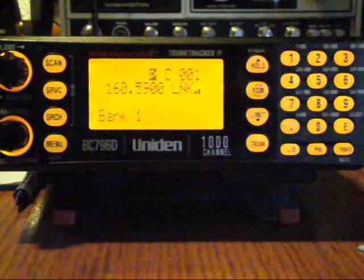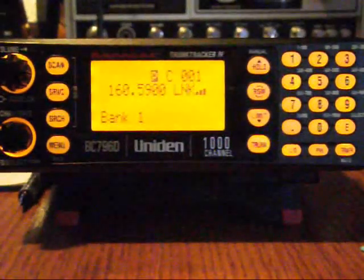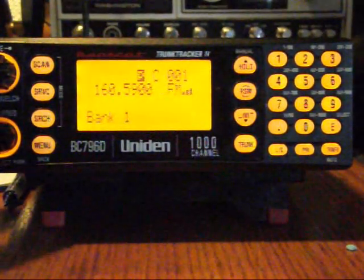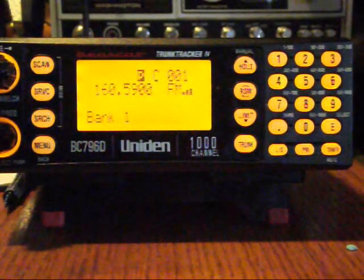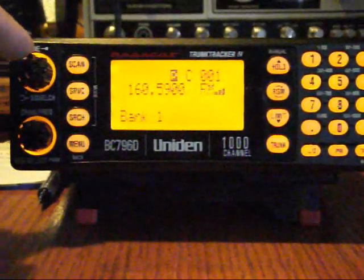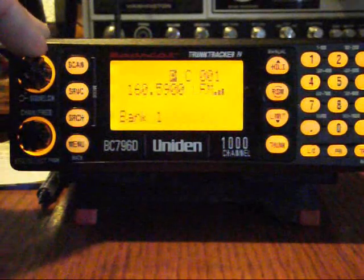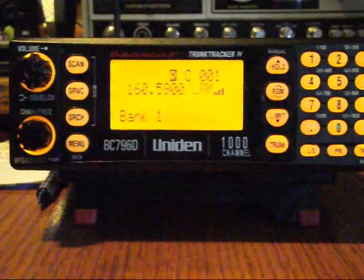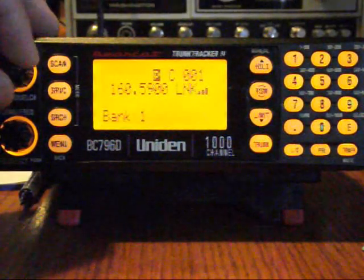The frequency they're transmitting on today says FM LNK. While still on that frequency, I'll turn up the volume so you can hear the carrier noise. The squelch is on the inside here — it's off right now — but I'm going to turn the squelch up and it should squelch the radio out, but it does not. It's fully on and there's still a carrier. Hence my problem.